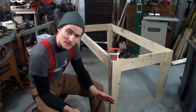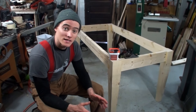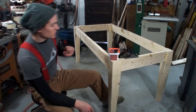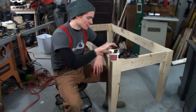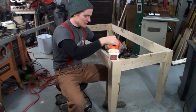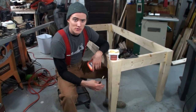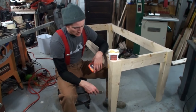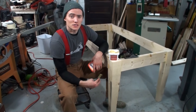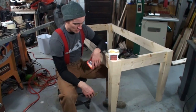These are 2x6's that have been laminated up and then sawed down to 4 inches and then tapered on the bandsaw. During the milling process, 2x6's are not perfectly flat on their faces. Most of the time I use a solid 4x4 — a true dimension rough sawn 4x4 — but in this case I want to demonstrate making these legs with material you can easily go to Lowe's or Home Depot or a similar store and buy.